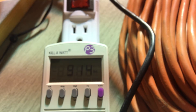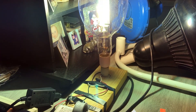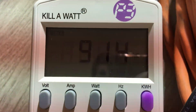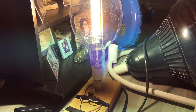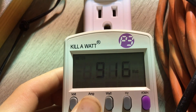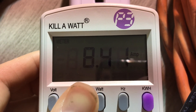The fixture is now at full brightness — really bright, as you can tell. 110,000 lumens from this bulb. It is drawing 914 watts, so this bulb is energy efficient. Let's see how many amps the ballast is drawing — it is drawing 8.41 amps. That's a lot of power.